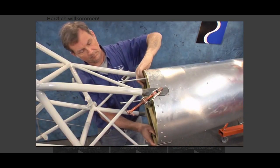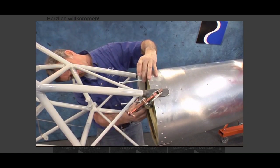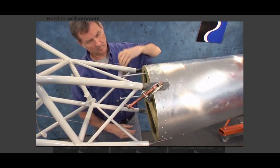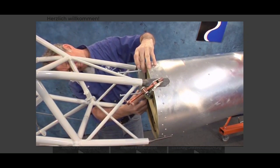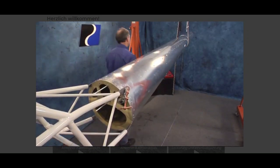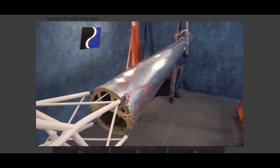If necessary, rotate the tail boom to maintain 90 degrees on the protractor. With bulkhead number 1 level vertically, check bulkhead number 5. Note, it is possible that bulkhead number 5 may not be level vertically when compared to bulkhead number 1. The intent is to have the best vertical positioning of the 5th bulkhead, while maintaining the location of the tail boom attachment brackets over the ears in the number 1 bulkhead.